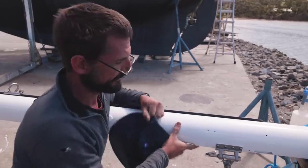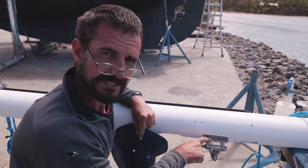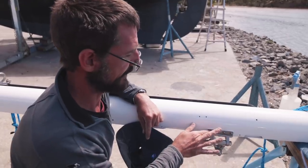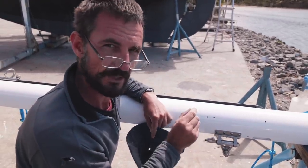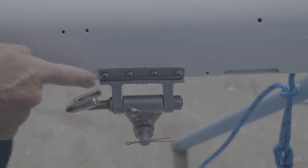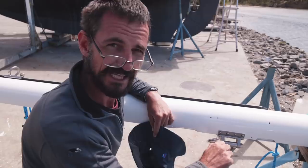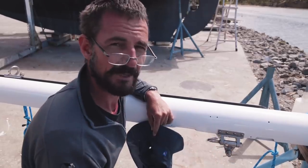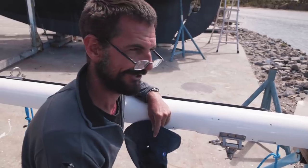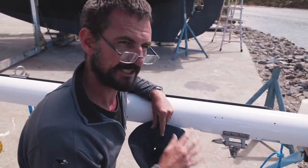Everything that we're going to be trying to use, I'll just give this a spin without dropping it off and cracking the paint. All of the fasteners that we're going to be using are these, if we want a nice finish head and we don't want a hex bolt, will be these button head socket cap screws. So we can put an Allen key in there and we'll always be able to get them undone. No Phillips and absolutely no slot head screws. So all of our fasteners will be really, really standardized.